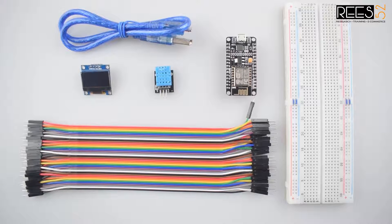This board requires 3.3V power supply and 3.3V logic levels for communication. The GPIO pins are not 5V tolerant. If you want to interface the board with 5V or higher components, you will need to do some level shifting. You can check the pin diagram.